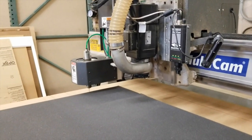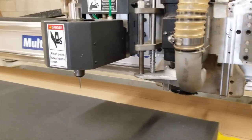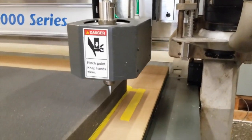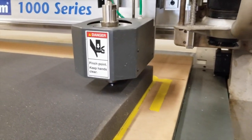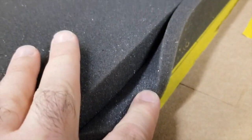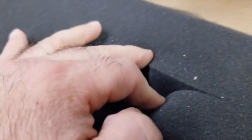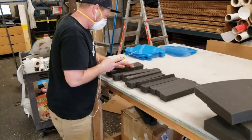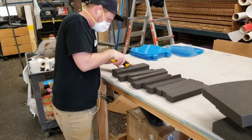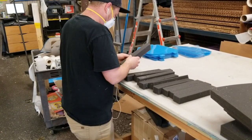Right now here's the router — we're doing the two inch foam. A lot of people had a lot of trouble with this trying to cut through it. I'm using an oscillating blade, it's about an inch and a quarter long, to cut guides through, and then our guys are just following the guides with the Olfa blade — it's an Olfa 25 millimeter blade — to finish the cut. If you do not have an oscillating tool, the Olfa blade is the correct tool to use to cut it through in one shot; you can get about four inches of blade out. Here's Lozak, right now he's cutting through the guide, just slicing it into blocks — the same method if you didn't have a guide.